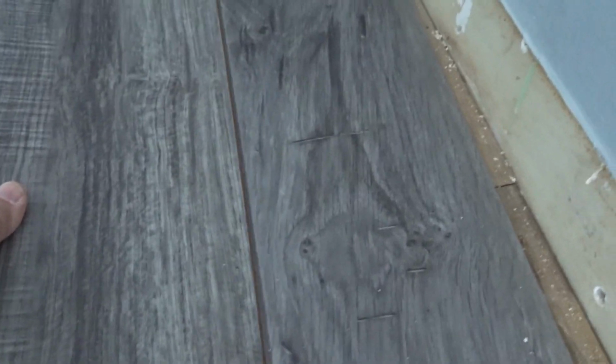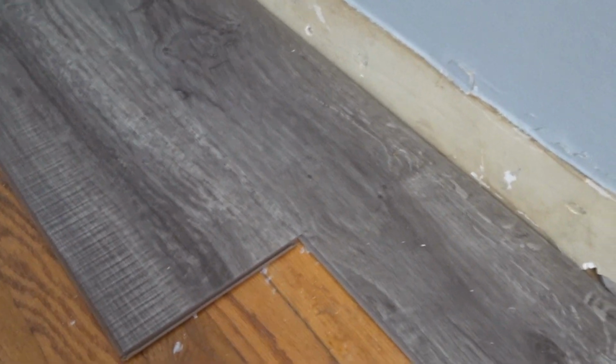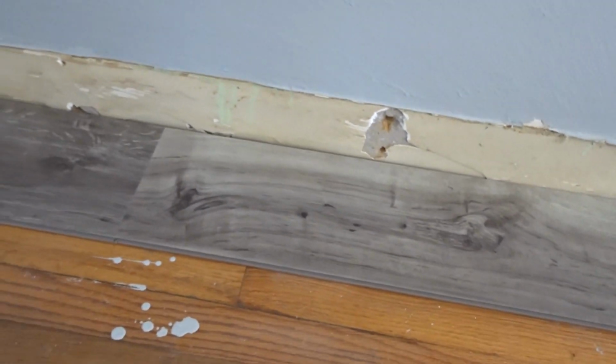So once we put the long joint of the flooring in, we slide it to the wall. Now you're going to hear people say you have to use spacers and stuff like that along the wall. Absolutely do, but let's start on the wall, get the first couple rows installed, and then we'll pull it out and put our spacers there. So we're not fighting it, trying to keep spacers in place and flooring lined up. Let's make it simple. We'll get 3 rows installed, we'll then pull it off the wall, and we'll leave necessary expansion.